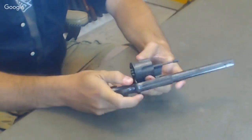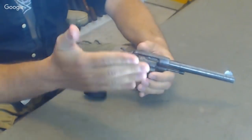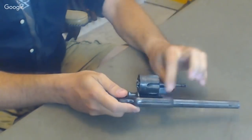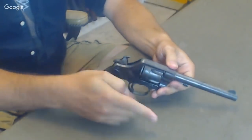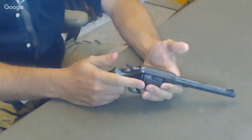When you index the cylinder by either pulling back the hammer or pulling the trigger through for double action, the cylinder rotates via what's called a hand or pawl, pressing up on the back of the cylinder — it has to stay in alignment with the bore. Otherwise you start to shave metal or worse, detonate and clip the inside of the barrel, causing a shattered cylinder. With a swing-out cylinder, timing becomes a critical issue, and these guns were not designed well — the cylinder rotation pushes against the gate, so over time the more you use the gun the more likely it is to walk out of time.